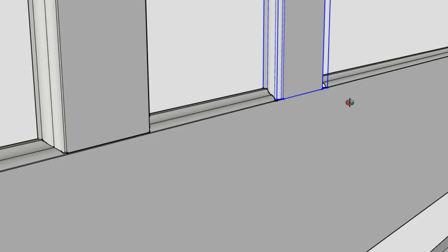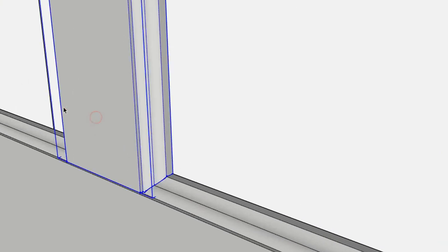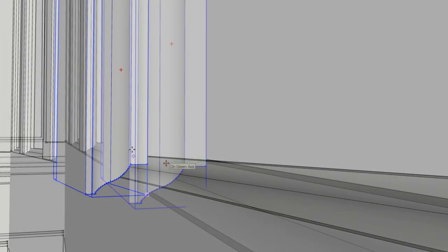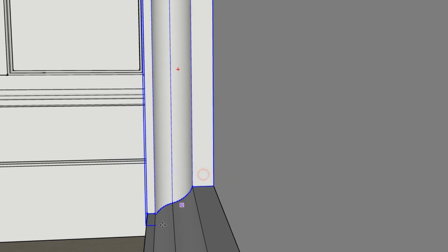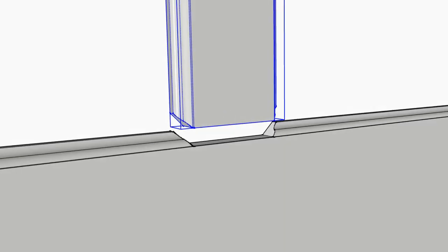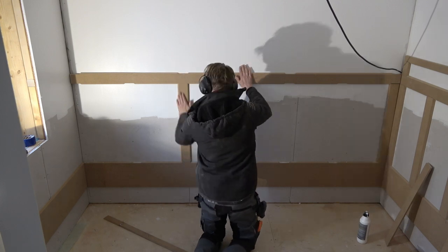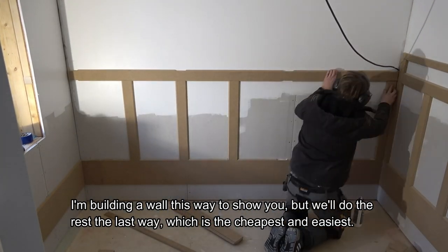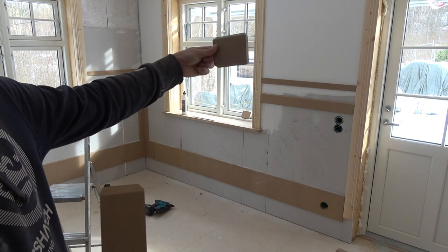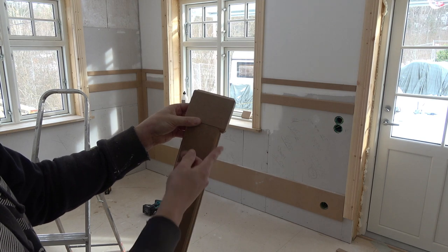So how do you get a sharp edge between the pieces? I know three different ways to do it: one is expensive, one is difficult, and one is easy. The expensive way: you can buy special router bits to cut a reverse profile so you can put the pieces together — this is a good way but these router bits are expensive and hard to find. The second way is good but quite difficult, as you have to be very precise — the milled edge is cut off at an angle and the same is done with the piece to be joined. The last way is like the first but without special tools: we simply cut the stud at a 45 degree angle. The ogee cutter we use is also 45 degrees, so they fit almost exactly. The small gap that occurs can be filled with putty using a finger.